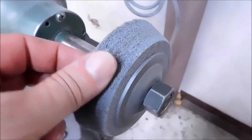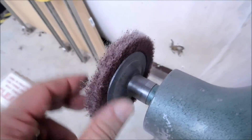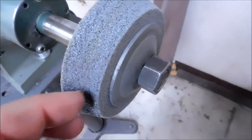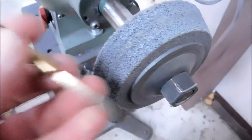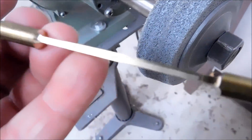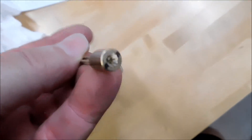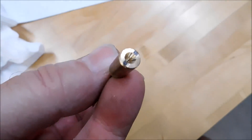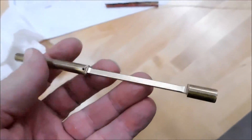This is my deburring wheel of choice for just about all materials — this is a hard Scotch-Brite fiber type wheel, it is not very flexible. This is the wheel that does all the polishing after the fact if you want to blend out any kind of lines, but if you want to cut your part down this is a great wheel to use. I'm going to edge hit this on here at a 45 degree visual and then buff it on the pink wheel on the opposite side — I just want those sharp edges to go away. The edges have been rounded off and smoothed a little bit off camera. I'll now pop a center drill hole in this and we're going to pop this in the lathe, hold it in a collet, put a support center out here and show you something pretty cool.